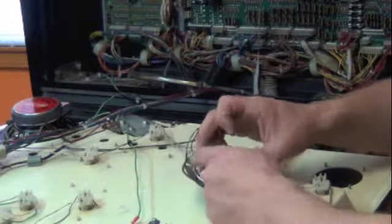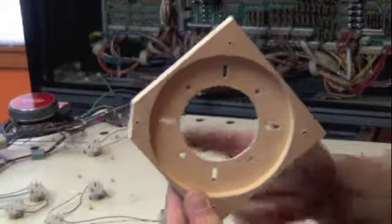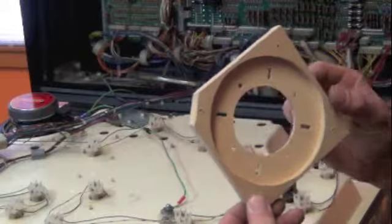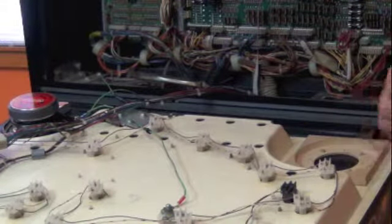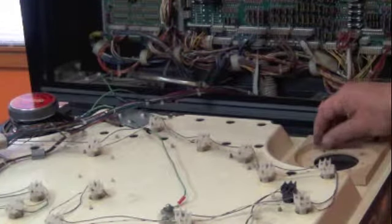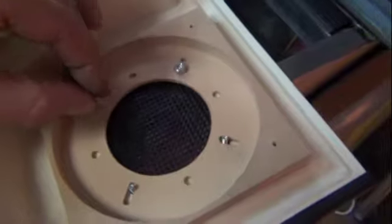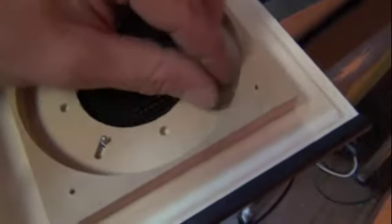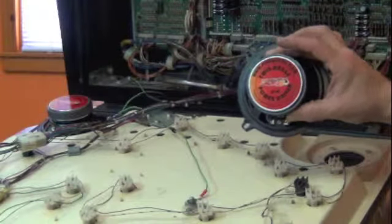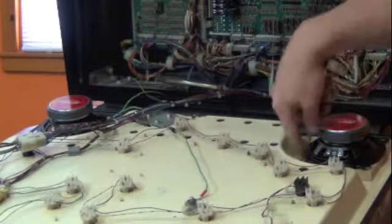You may choose to desolder or snip these wires as well. Then utilize the supplied adapter with the removed corner — the removed corner will need to be oriented so as not to interfere with the back box tub. Then utilize the supplied factory nuts to install the plate. Then install the Pinball Pro 5.25 inch speaker to the adapter plate utilizing the four screws included with your kit.